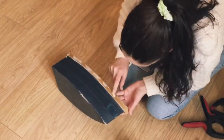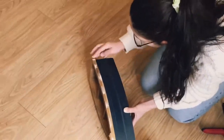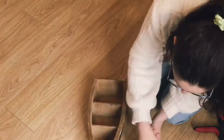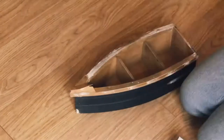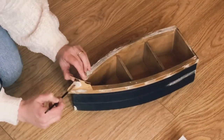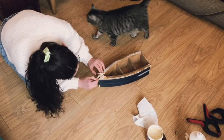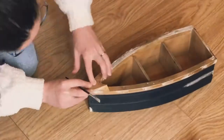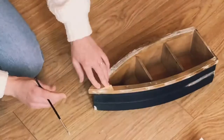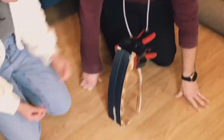This smaller boat has actually got a slightly damaged area on the front — the veneer is peeling away and some of it's actually broken off. So this is going to need a little bit more of a thorough repair. I'm going to fill around it, then get in with the wood glue and make sure that piece of veneer is stuck back down again. Oh, cat — hello cat!